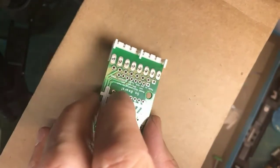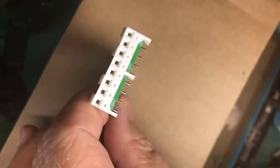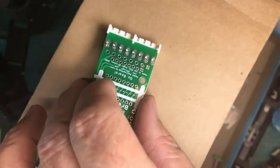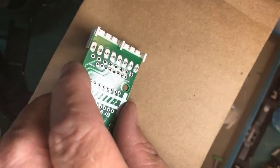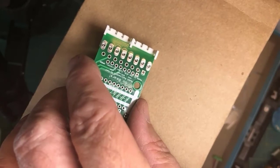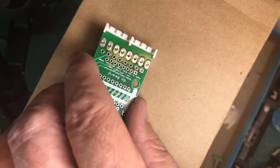All right. Now, here you see the connector that's going to connect up to my Chubb S Mini that's going to have inputs and outputs connected through these cards. And of interest here is that you may notice that the leads are much smaller than the holes, which is an interesting challenge for soldering, because it is easy to make mistakes. When the lead is a very tight fit, things work better, but this is a great way to show some of the ways things can go wrong.